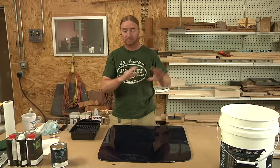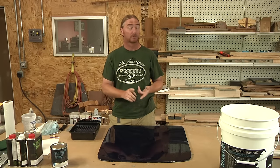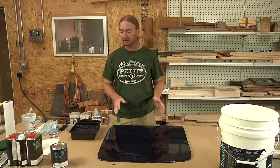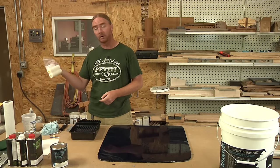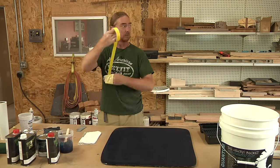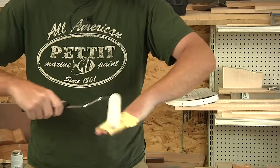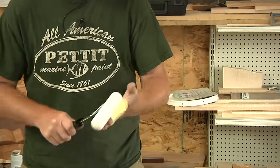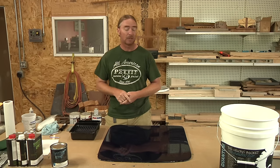So I'm going to save you some boredom. I'm going to take this outside, wet sand it with some 600 grit, come back in and clean it, and then before we apply our second coat, I'm going to take one of these rollers and roll it back and forth for a minute or two over some tape, so anything that's on there the tape will be able to pull off and we'll get a nice clean coat. Let me get this prepped and I'll be right back.